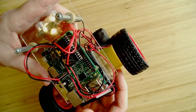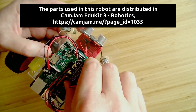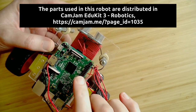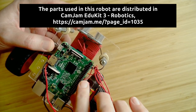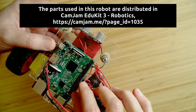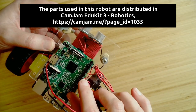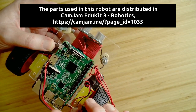So that's the board, keeping in mind, again, how to access things on the board. This kit comes with this motor controller board that sits on top of the Pi. So this is your general purpose IO bus here. Now be careful with this. Understand that this is a direct connection to the pins on the computer itself. So it's very easy to make a mistake and connect something wrong. And if you do that, there's no buffer and it becomes very easy in some cases to just burn out your board by connecting the wrong voltage to the wrong pin. So again, be very careful working with that.